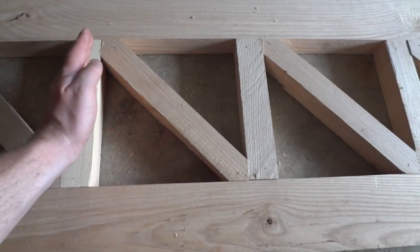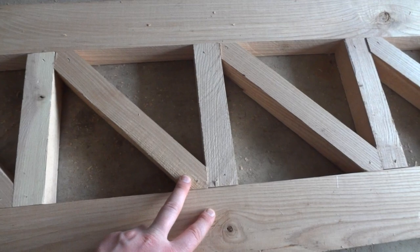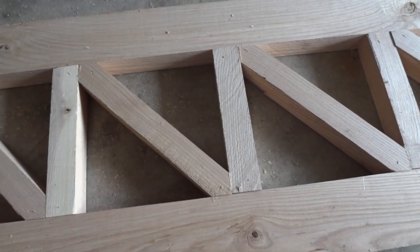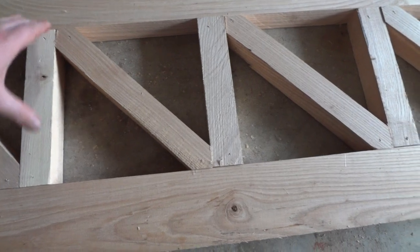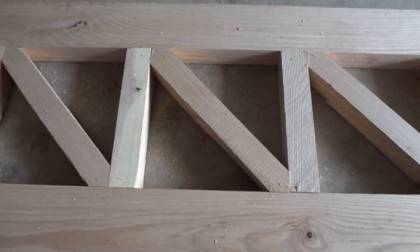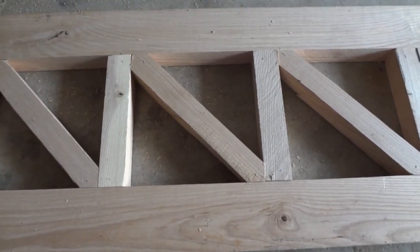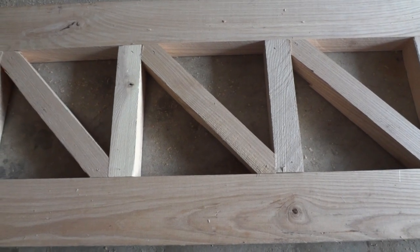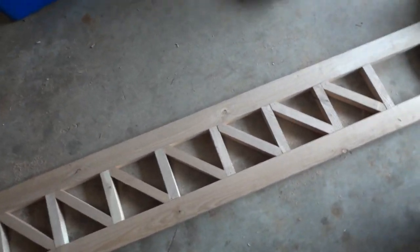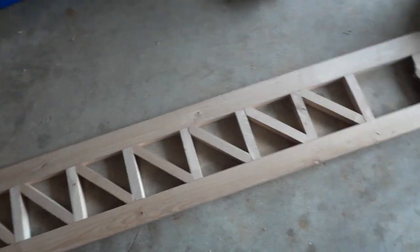But I wanted it this way — the tension joints are the hardest to create and hold secure. So I'm going to be putting some construction adhesive in all of this and then screwing it down. The compression members, just from the bearing surface, will be held together. I had considered that I might not even need these tension members and that the strength of the plywood on either side would transfer all the tension, but I figured this being my first one I would make it as conservative as I could, so that if it breaks I know I did everything possible to make it hold together.